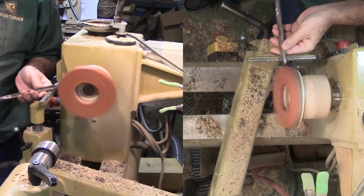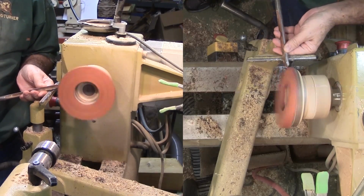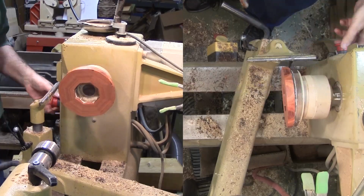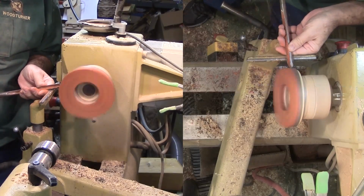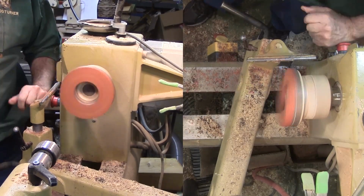One of the challenges for this bowl is starting to show up. Since I'm lining up the thin sides of the rings, trimming the perimeter is seeming like a multi-axis turning. There's a lot of air on the short side of the bowl as it comes around. Fortunately, the ghost image gives me a clue as to where the wood is.